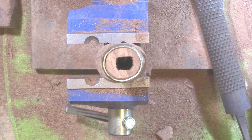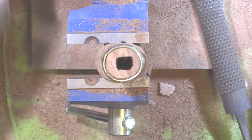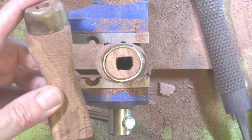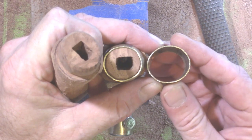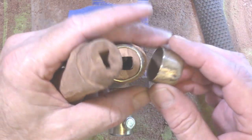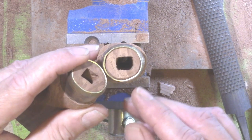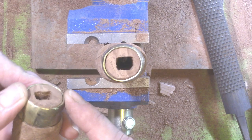As you can see, the giant woodpecker has been busy making all sorts of shavings. The shape of our handles has changed quite a bit since you last saw it, although it has the general theme. I made these brass ferrules — I didn't have any tubing so I just cut out some sheet, wrapped it around in a circle, and silver soldered it. Then formed it into an oval onto the handle.